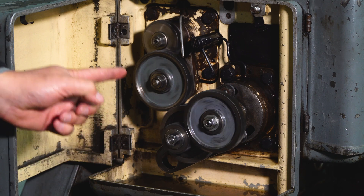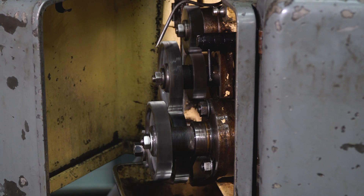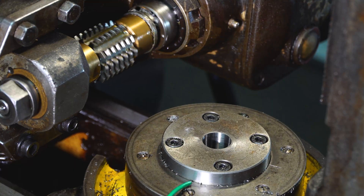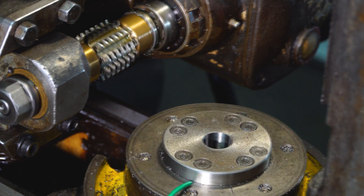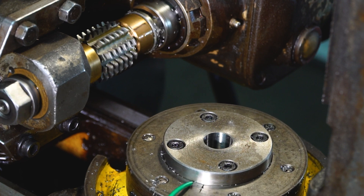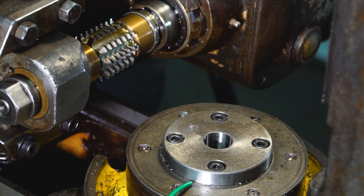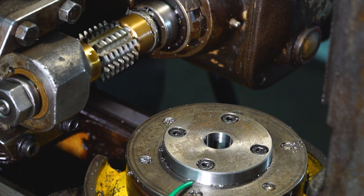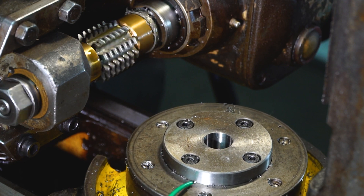Note that those two nuts don't move, but these do on the shafts that go into the machine — that's how those quadrant posts are supposed to work. The correlation between the rotation of the hob and the rotation of the gear blank is what the machine does. The whole gear train gets the platter — which the little green pointer is pointing at — to rotate proportional to the hob. In this particular setup, if the hob goes around 16 times, the platter and gear blank will go around once, giving you a 16-tooth gear. That is the hobbing process. It's very reliable and gives a high quality blank.